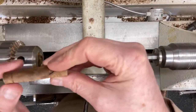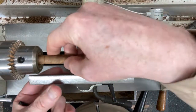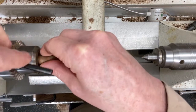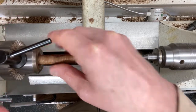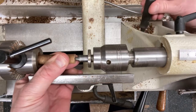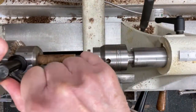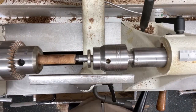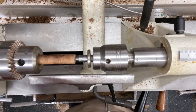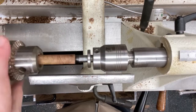We've now made a load of these little cylinders. The next stage is to mount them in the chuck the right way around, bring up the tailstock to the center already in there from earlier, and tighten that off. You've got to be careful with the chuck - you don't want to run it without a tailstock because the chuck will potentially come out of the headstock. So that's mounted in there. What we're trying to make is like a little teardrop shape.